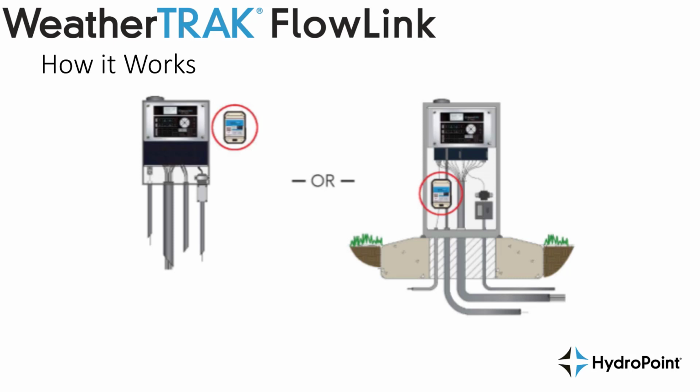If you've got a wall mount controller inside the box, there's enough mounting hardware to mount the box right next to the controller and extend the wires up through the bottom of the controller. Inside a pedestal mount controller, I often see two-sided tape or Velcro to strategically position the CT inside of the pedestal in a position where the CT wires can be extended to the necessary valve wire terminal ports.